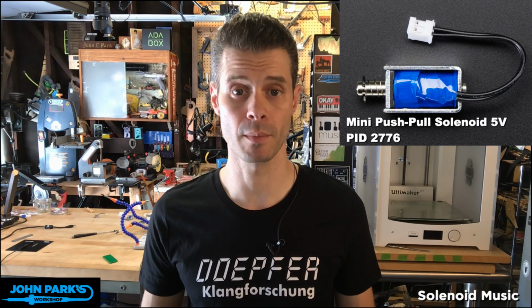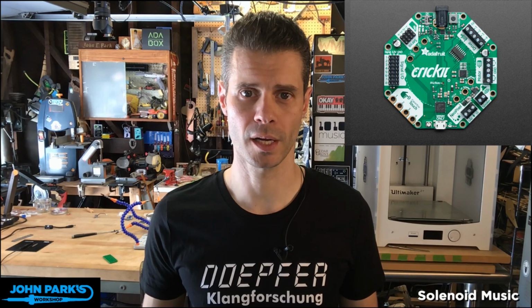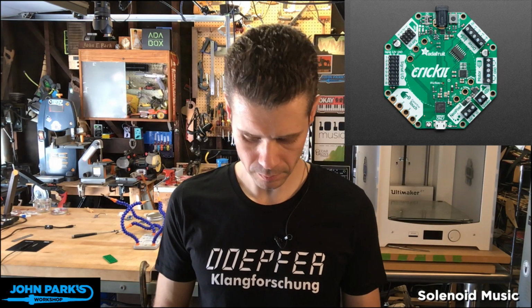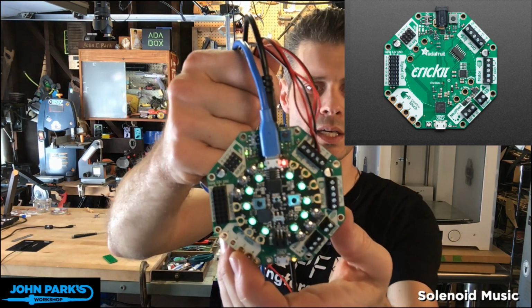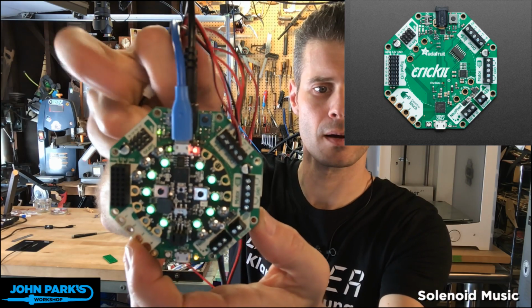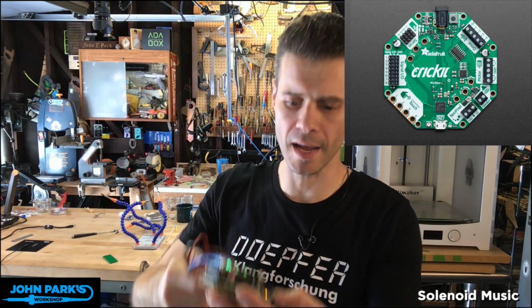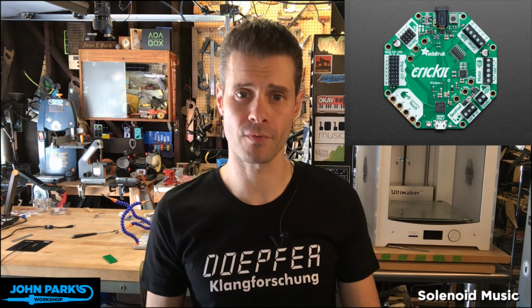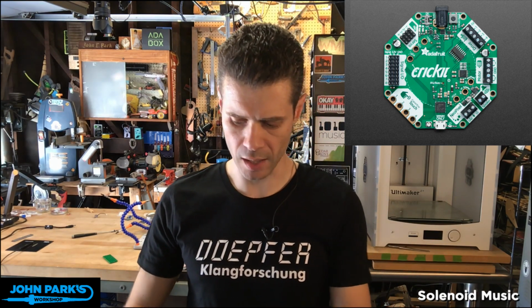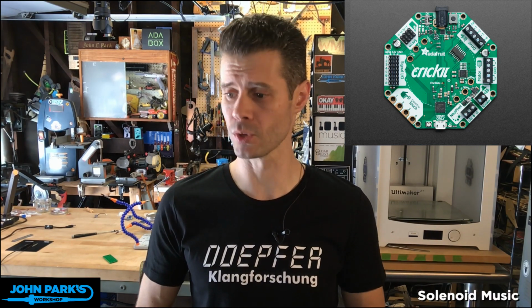But those little solenoids, one reason I really like them and the way we're going to use them today is because you can run them off of this guy, off of your Crickit board. Oh, look. I have one right here. It's wired up to stuff. And you can see in the corner, right there, oh, I'm going to touch the wrong side because I'm looking in the mirrored image. We have this section of drives. And so this section of drives on the Crickit board can drive up to 4 electromagnets or solenoids. I don't know what all else you can run off of them. I suppose if you got anything that just wants to get hit with 5 volts, you can do that too.